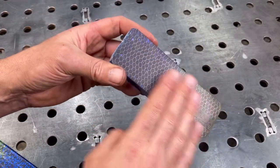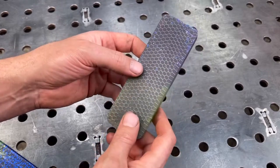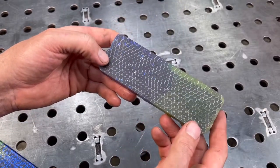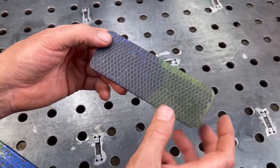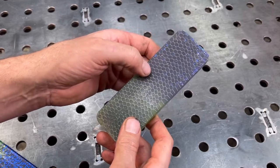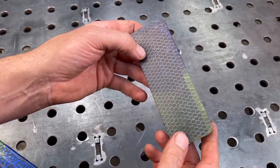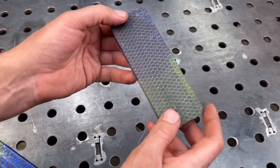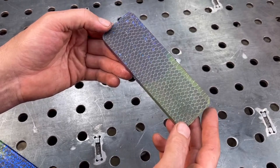That's after a little bit of sanding and a little bit of polishing — looks pretty nice. I recommend if you do a knife scale from this and you want to finish it with a high gloss, you can polish the epoxy, but if you clear coat it after, it really shows the depth of the color and the flakes inside and the aluminum honeycomb. And the aluminum honeycomb doesn't necessarily have to be pulled out all the way — it can be crinkled in certain spots just to add a little bit more texture. Overall, the aluminum honeycomb turns out really nice for knife scales.